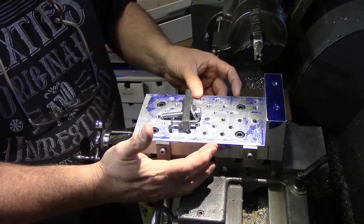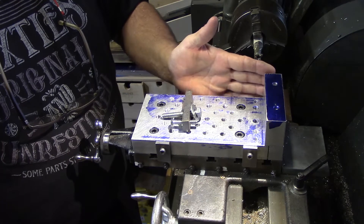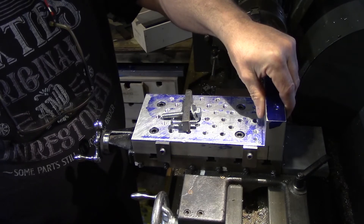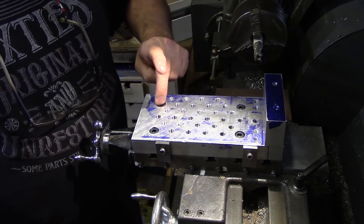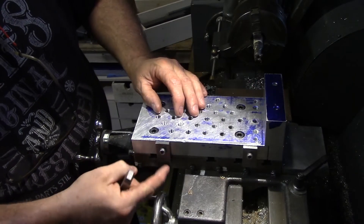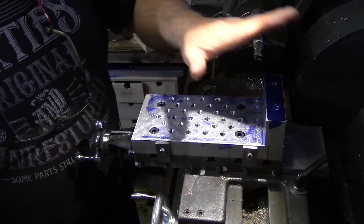It's basically a one-inch thick piece of aluminium slab, 100mm wide. I chunked off the end, mounted it in my vertical slide so I could mill it flat, and then it's been bolted from underneath with a couple of dowel pins put in the top to hold it square so it's not going to move around. I drilled and counterbored four holes which line up with the T-slots in the cross slide, and these two little pieces of mild steel clamped on the side let me pull it up tight against the edge of the cross slide so I know it's all square. I also run a clock along it just to check it's bang on square.